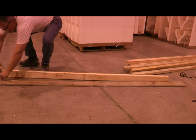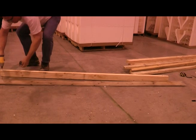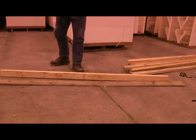In preparation, build strong back L's out of dimensional lumber as required. Also pre-bend two 90 degree pieces of rebar per row of block.